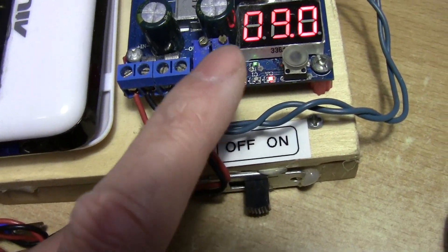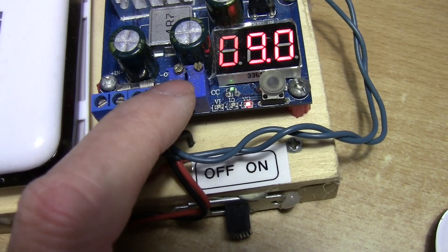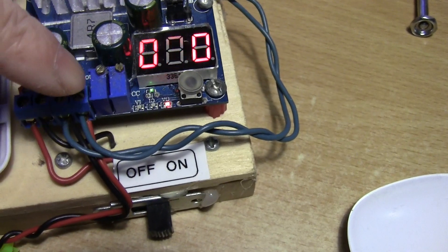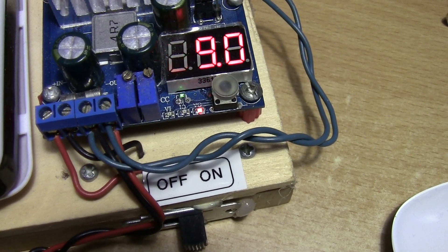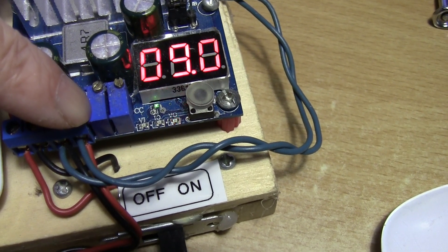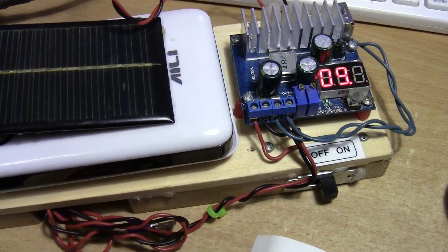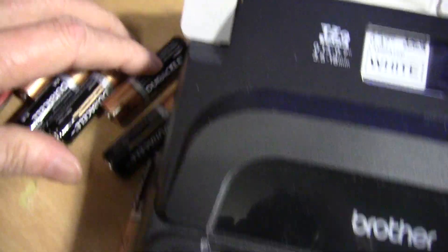What I'm planning on doing is putting in a potentiometer here with a knob. You see this type of potentiometer requires a very small screwdriver to make the adjustment. I'm thinking of adding a pot with a knob to make it easier to change the voltage. The voltage pot I have here is a 50k, so I just have to replace it with one that has a knob so I can make adjustments more easily.